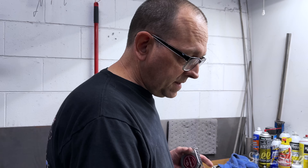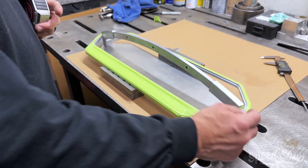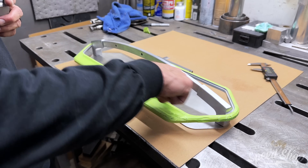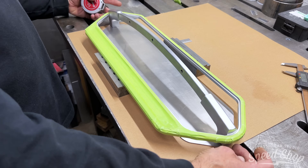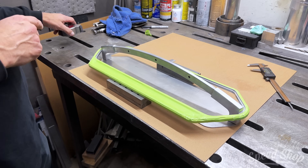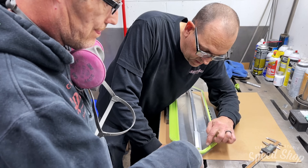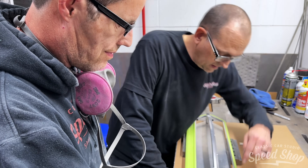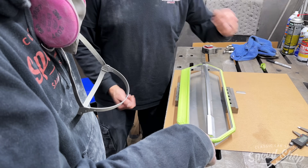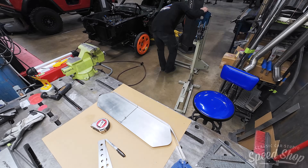The idea is to make a top and a bottom and put the weld where it's hidden behind the handle. With the gauges in the other one there were places to disguise things, but on this one it's open — so we'll put the welds behind where the handle goes and then there'll be no bodywork. That inset gives you three inches here — that's plenty. It's about an inch and a quarter deep. Looks good, it's going to look nice.